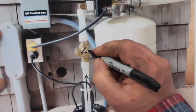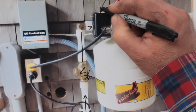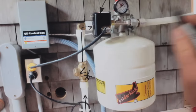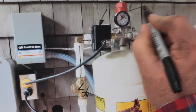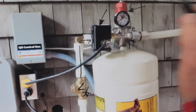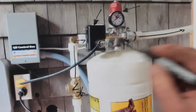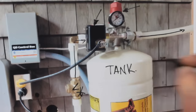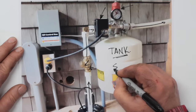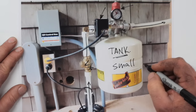This is the intake line here in an overview of the system. This is the pressure switch, which turns the pump on and off. This is the pressure gauge that shows you the water pressure in the tank. That red thing is the top of the cycle stop valve, very important and I'll talk more about that later. And then that's the line going to the rest of the house. This is the water tank — you'll notice it's very small, and the ability to have a small tank is one of the advantages of the cycle stop system.